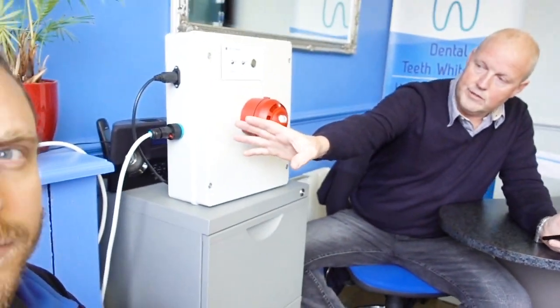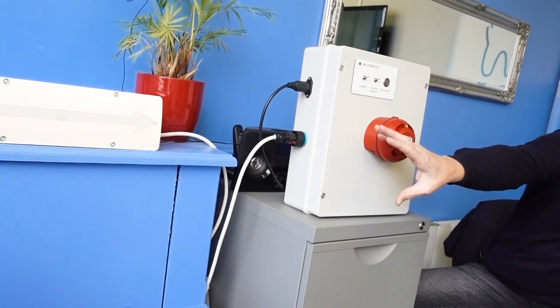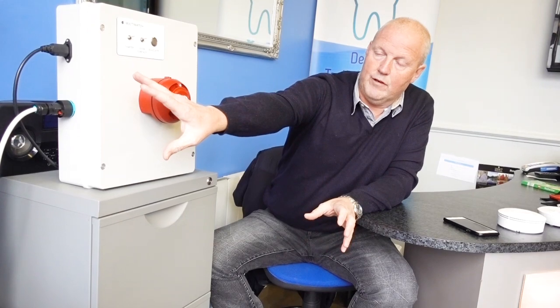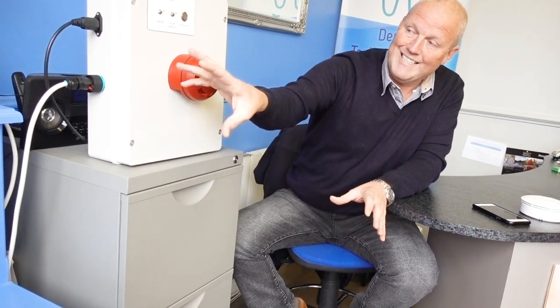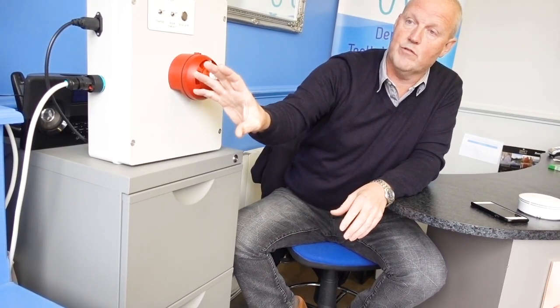And then also, Dan, to go back onto the Light-for-Life unit, as we closed the fire alarm down, it closed the Light-for-Life units down because there was no longer a requirement for it. The concept behind the Light-for-Life unit is that if there is a fire alarm activation, it can trigger on in the common parts areas as a wayfinding strategy to get you out or assist firefighters if they were in the building. Once it's closed down, it will trigger off. People may argue it's not needed when it is on, but we believe it is because it's arming ourselves in readiness for an evacuation.